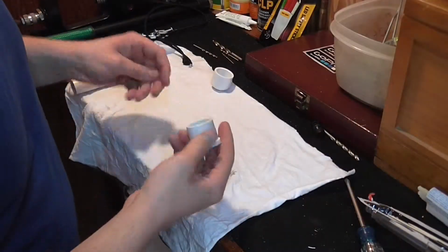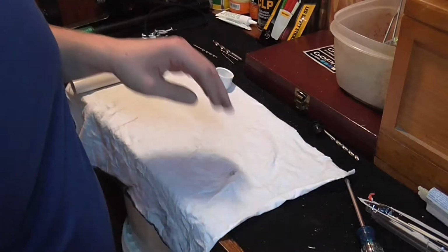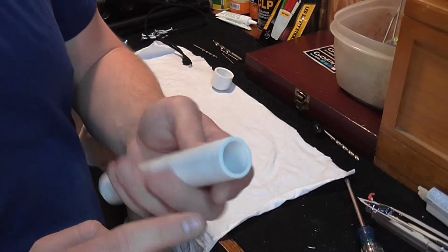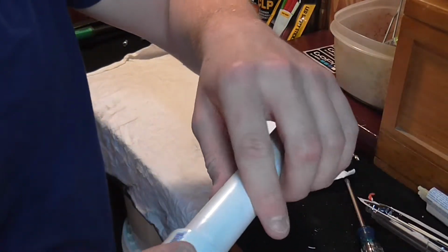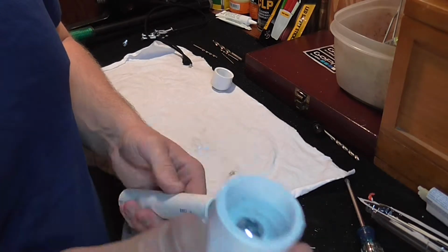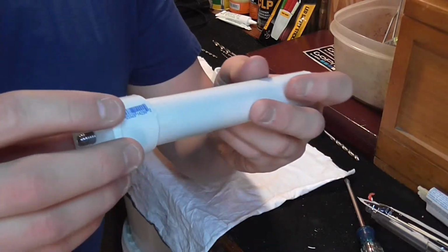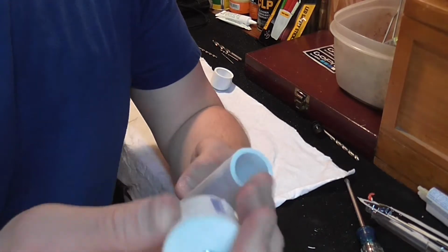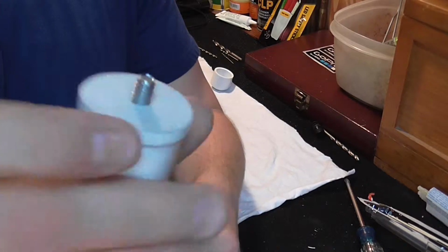Okay guys, so I'm finally back. I had to sand that all out with the Dremel. Had to make it much bigger, and then I had to file this down and sand it a little bit and make it nice and neat as much as I could. There's a little bit of a taper there to get this to fit in there, because that is a 1-inch plug. This is a 3/4 inch piece, so I actually had, like I said, instead of having this go inside that, it goes over it. It does sit mount flush, and that is in there.